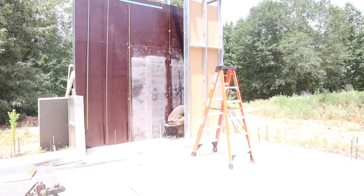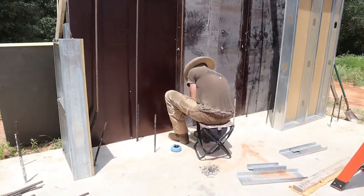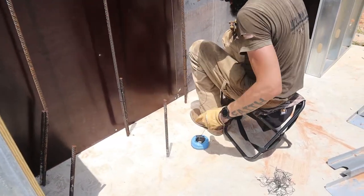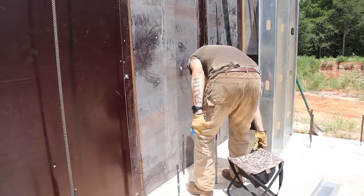Yeah. Okay. So if you didn't catch that, we decided to take out the 5-foot sections of rebar, and we'll use those as horizontals. And we're just going to put verticals in that go all the way from the bottom to the top of the form where we need them, so that we aren't dealing with pokey rebar at increments all the way up. Ricky's tying in the corner ones back there. Yeah, look at it. Oh, and then you pull from the center? Yeah. And then you can stand it up and it's just right here. Nice. Hey, you want to hand me another piece of rebar? Sure.